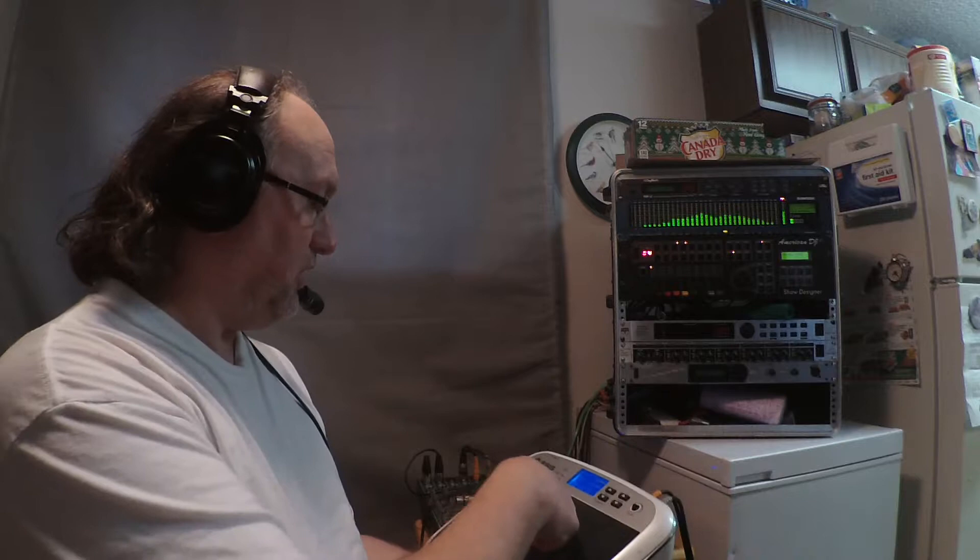I have it hooked to my soundboard on the insert, and I have a looped port on that. When you plug something into the insert, you interrupt the channel inputs and outputs so you can put effects processors or whatever you want for mixing. That's how I hook into it for the kick drum. When I'm doing live sound, I always look for the kick drum, put the mic right there, and every time that kick drum hits, the lights will trigger for every sequence of the drum kick. I'll go ahead and tap the pad.